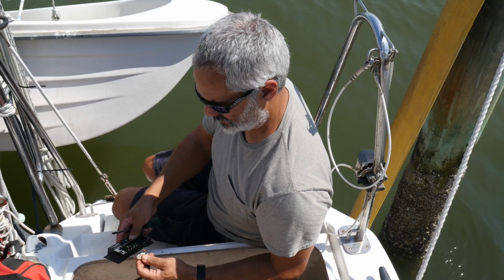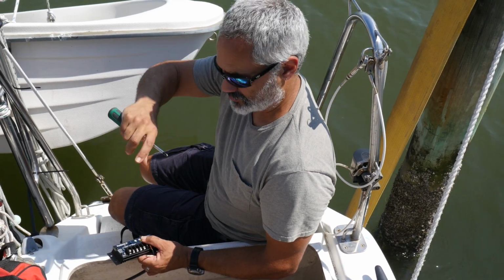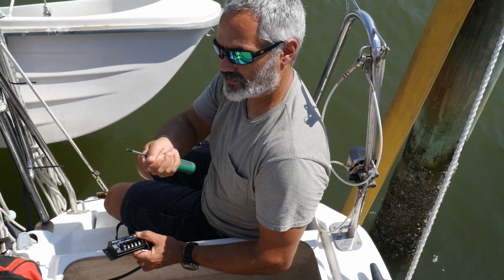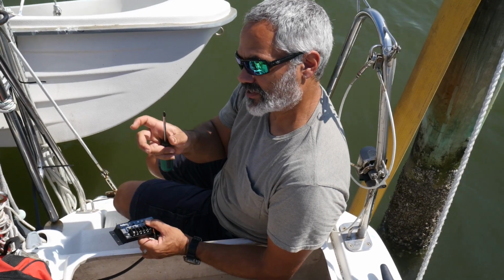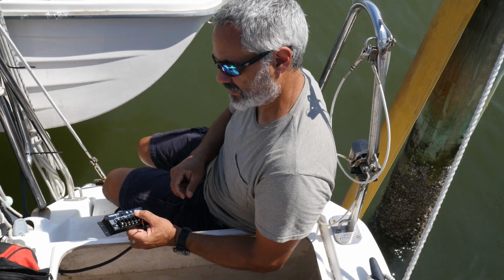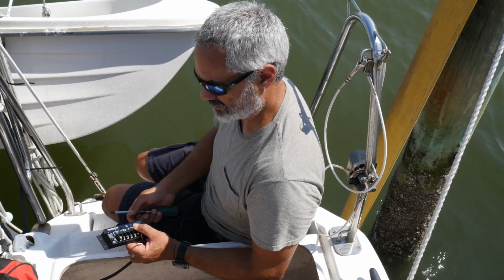And the other thing is, when you're screwing the screw down, if you're going to use wire like this, normally you like to wrap it around the screw so that as the screw comes in, it pulls the wire in, instead of, if you wrap it the wrong way, it'll try to push the wire out. So that's one of the things that you think about if you're not going to use a connector, that you also don't have to think about here.